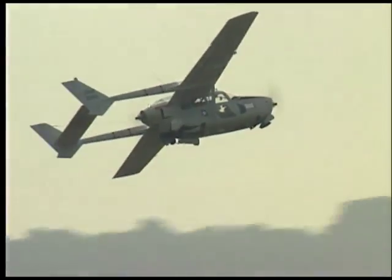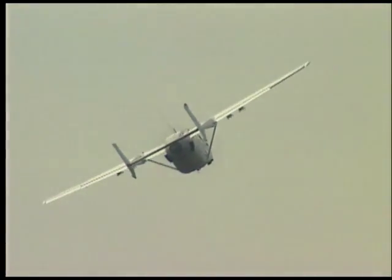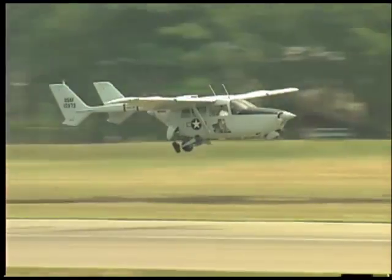The landing gear in this plane is rather unique. When it retracts, the large gear doors open, and then it will swing down, and it turns and pivots and goes back. And it swings from side to side, so it looks like a duck waddling on takeoff, and you see the legs swinging and going back and going up. So it got the nickname the duck from that. And after the wheels are tucked up in the wheel wells, then the gear doors shut. So it's an interesting gear mechanism.